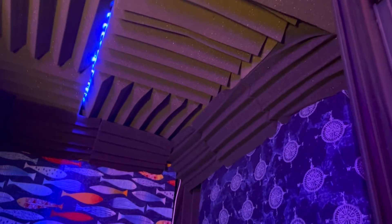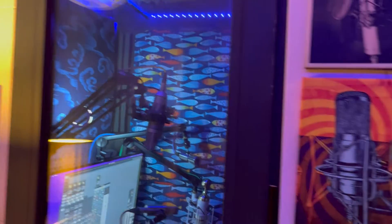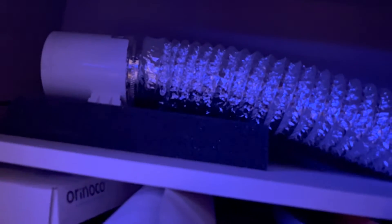There are LED lights on the inside because they're very low power, and I like the vibe. I've also got LED lights on the roof of the booth just to give it a little more vibe outside. Up top there's a ventilation pipe — when you get the booth it's just an opening with a cap on it. I fitted a flexible ventilation tube that goes to a fan on the other side of the closet. The fan runs very low, just pulling warm air up and out, and I can't hear it. There's also another fan below that came with the booth, but it runs on 220V, so I had to buy a converter box from Amazon. You get pretty decent ventilation overall.